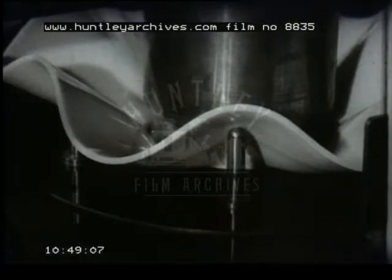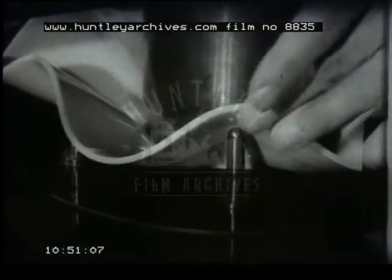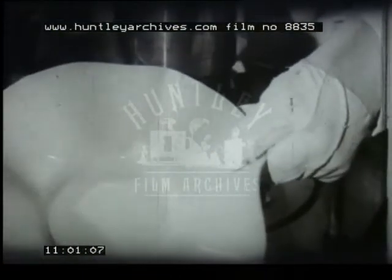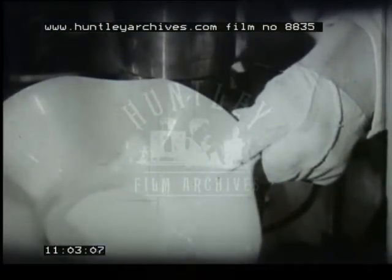The next material illustrates the use of very simple tooling. The material is a disc of delicately tinted opaque acrylic sheet. Six pegs are so raised that when the centre plunger is dropped, the edges of the sheet drape in natural corrugation. Only a little mould marking is shown in the angle of the base. The edges of the disc were previously polished so that no further finishing is required.